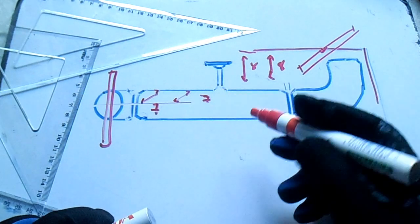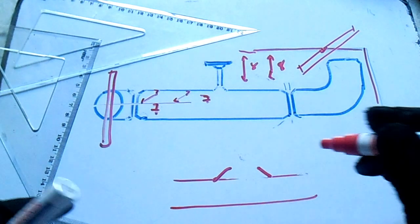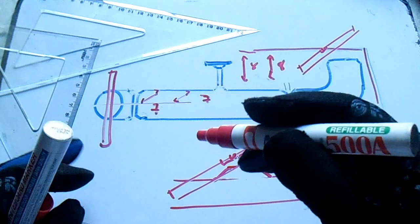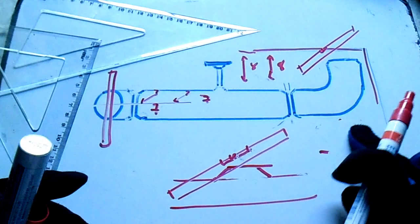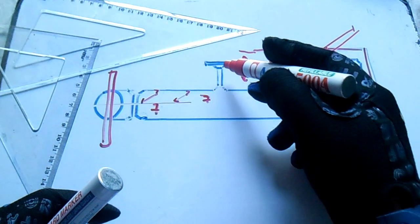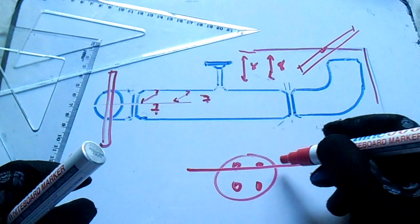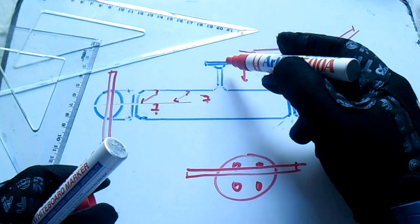For the weld outlet, we have a pipe here — this measurement is 5 and this is the outlet. Place the spirit level here for the x-axis and the y-axis. After that, do tacking, then check fit-up on this flange and check fit-up on this flange, making sure your holes are in alignment.